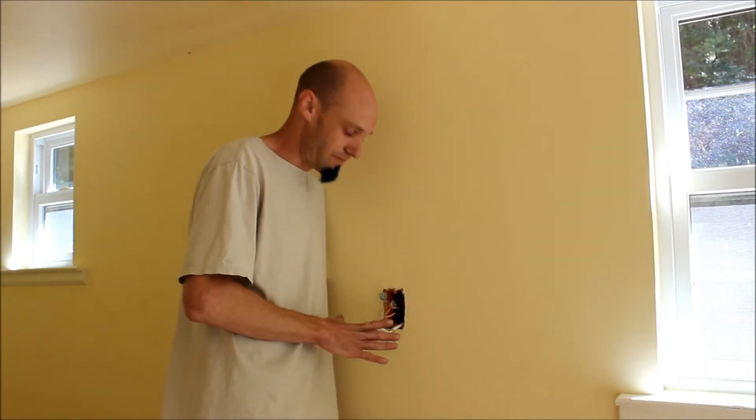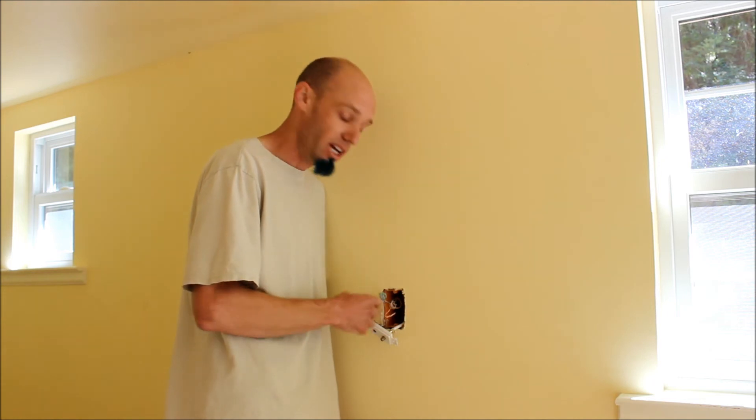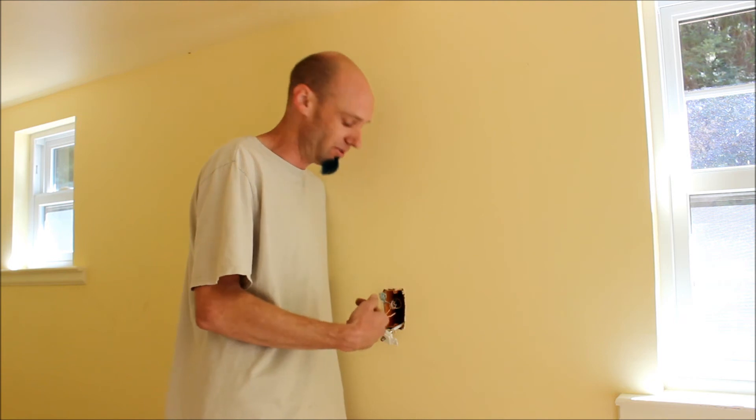Here's the inside. We've got an orange low voltage box which is different than the high voltage boxes because this one's a lot more open and exposed and easier to work with. It's got a big hole in the bottom, a big hole in the top, and nothing in the back. It makes it really easy to fish your wires through.